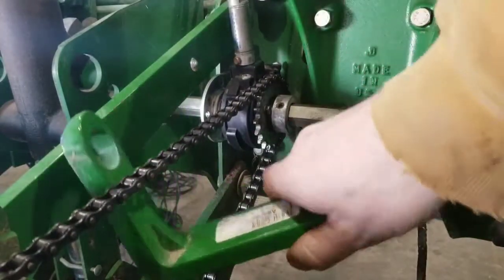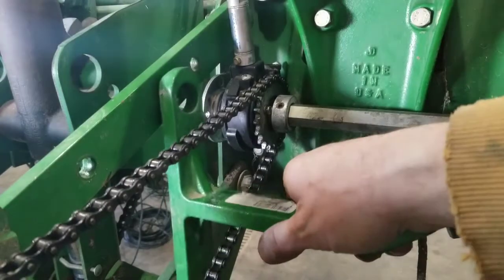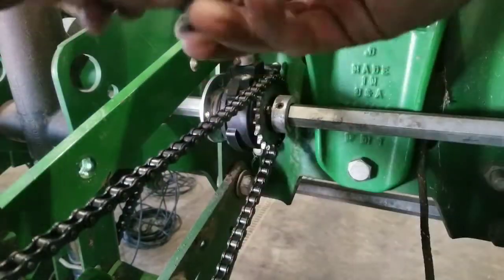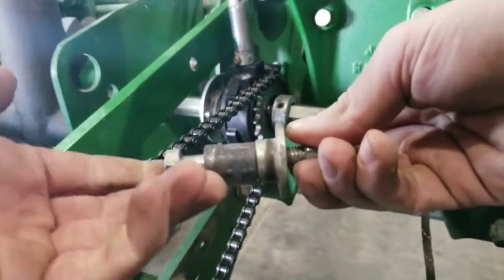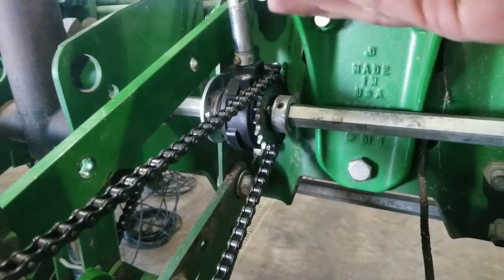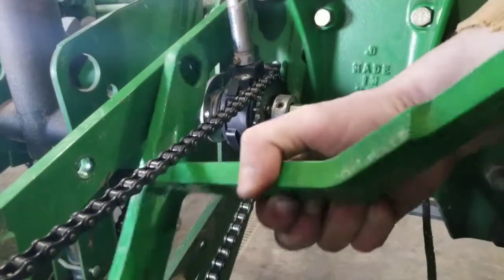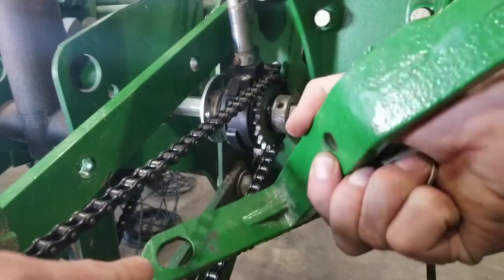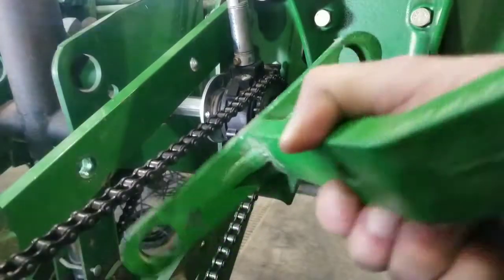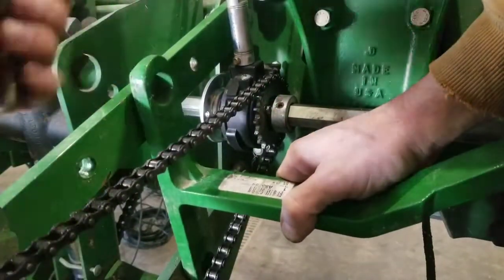This was a takeoff from a 1770 is where this kit actually came from. You've got two bushings — a bigger one and a smaller one. The one in the bottom is kind of an elongated hole and it's narrower, so the smaller bushing is the only one that will fit into that. The two top ones will take the bigger bushing, the ones on the bottom will take the smaller.